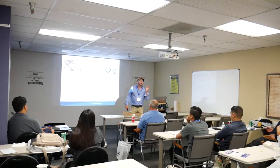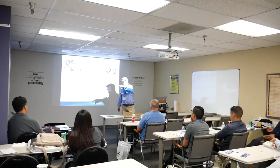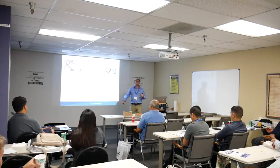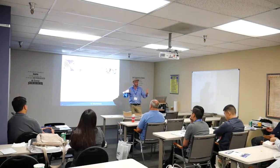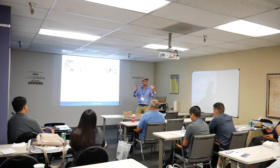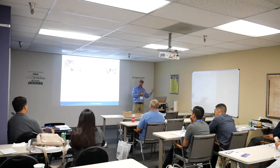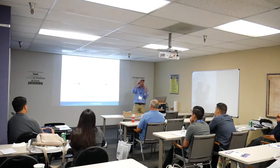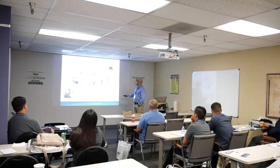The oil-based hydrocarbon pump may contaminate sensitive processes — like at General Atomics, in the water industry, or in cannabis processing. The alternative is a dry pump. You can order a leak detector with either a wet oil pump or a dry pump depending on your application. A dry pump uses two scroll modules — picture a cinnamon roll rotating — that grab air, compress it toward the center, and exhaust it through the middle.